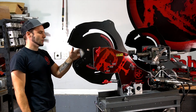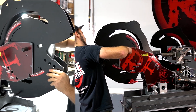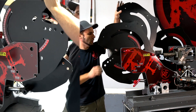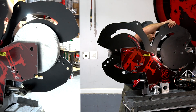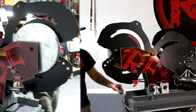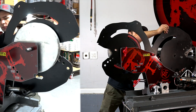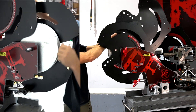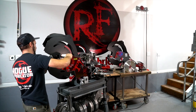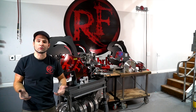There's the challenge of trying to put the washers in between the die and the bend wheel, but there's an easy solution for that. All we're going to do is free that bend wheel top and bottom and push it out of the way. Once it's out of the way, it's extremely easy to just put the washers right on the pin. Remember, we're going to pivot the bend wheel back into position and just keep those washers out of the way. And that is the easy way to change dies with washers without our billet spacers.